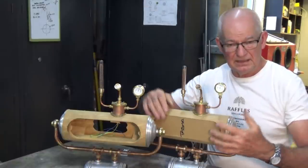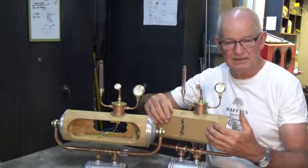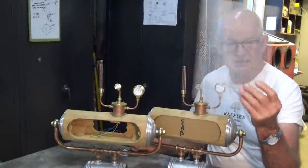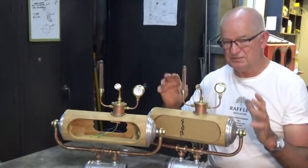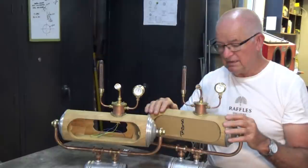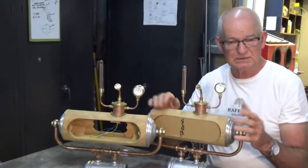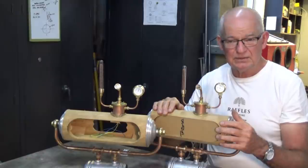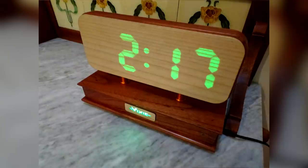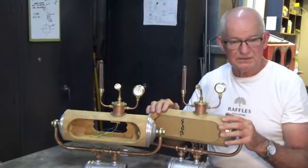In order to get the guts inside the clock, I need to make the screen. The screen is in two parts — it's a clear acrylic screen which is sandblasted on one side to create a sort of a diffuser, and then over the top of that we're going to fit this very fine stainless steel mesh — that's purely decorative to give it that steampunk look. I've made a number of these clocks before in different styles. One was a mid-century modern style, which I called a Vixie, and the other was a Victorian-inspired style. This one though — full-on steampunk.